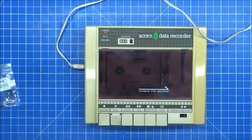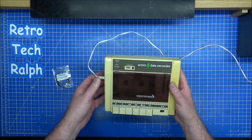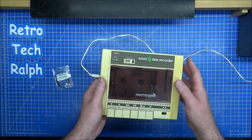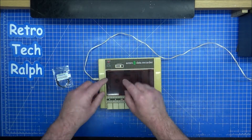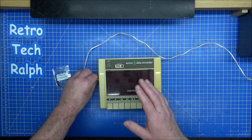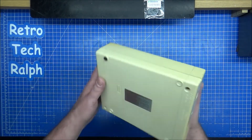I had already opened this and had a good look inside. I started it up, it spun round, the counter went around perfectly fine, and then I looked at it and it had literally just snapped. I picked all the pieces off because the belt only goes round a short distance — it was just squashed together like a little ball of rubber, just on the turn to go. So I'm assuming the main drive belt will be going too, so I'm replacing both as a precaution. Unplug, safety first.